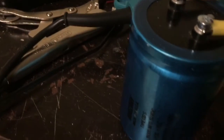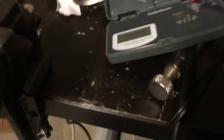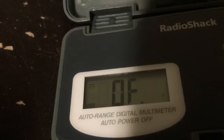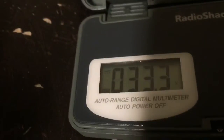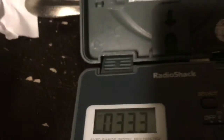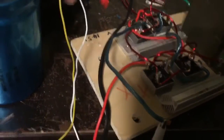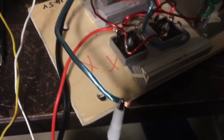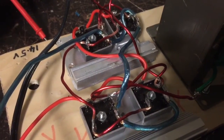I'm going to turn it on and see what we get for the output — it should be around 30 volts. I'm just getting ready to probe it. And here's my output: 33 volts, which should be good for some induction heater projects I've been working on. It does not look like anything's heating up — all of these are staying cool, there are no shorts, even with the messy wiring. We'll get everything connected up and test it out.